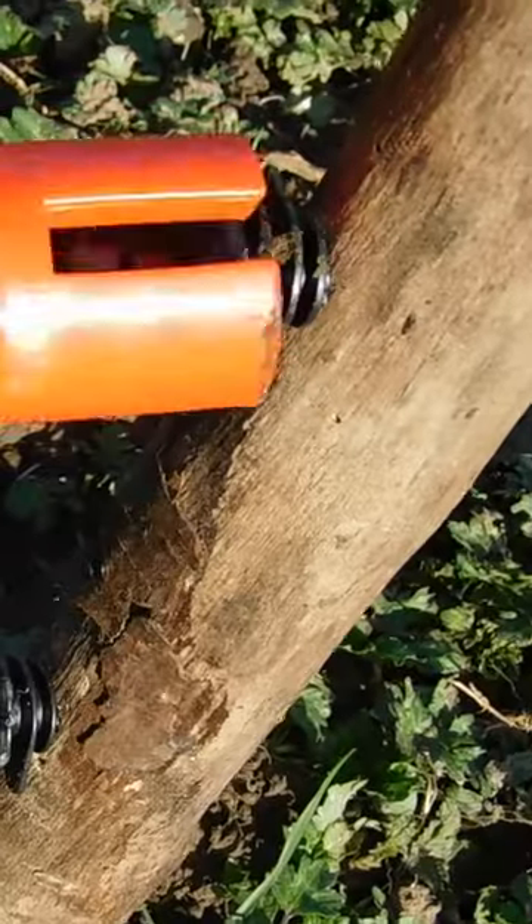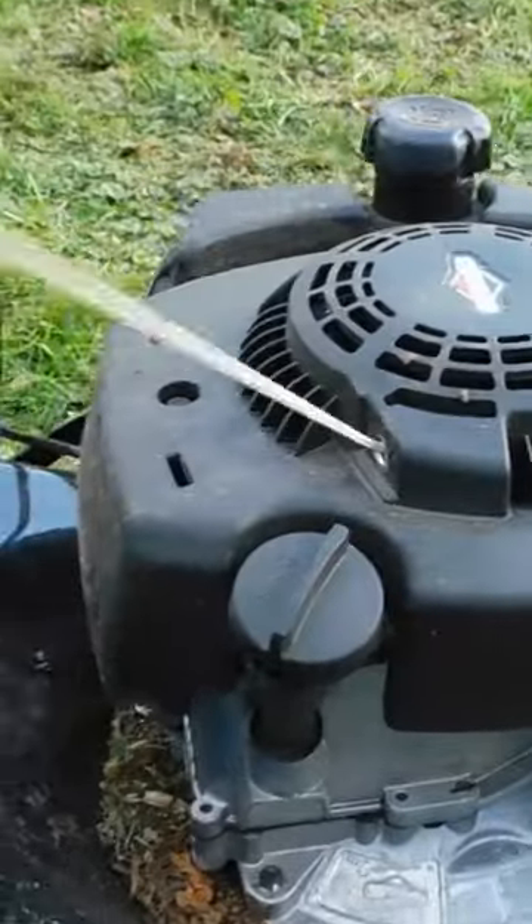Now I'm drilling 6 ring insulators into each post. I used 12 insulators on the corner post. After mowing so the fence reached the ground, I attached the wire to the end post with strain insulators.